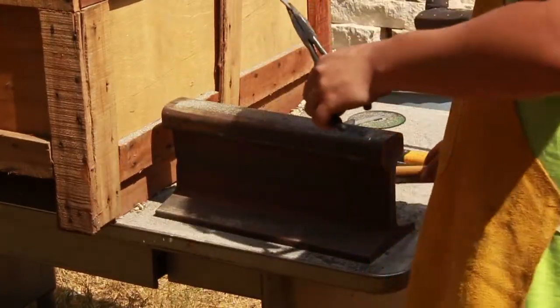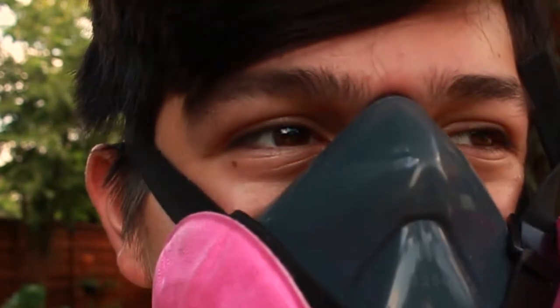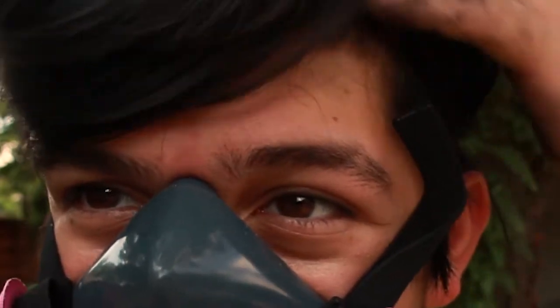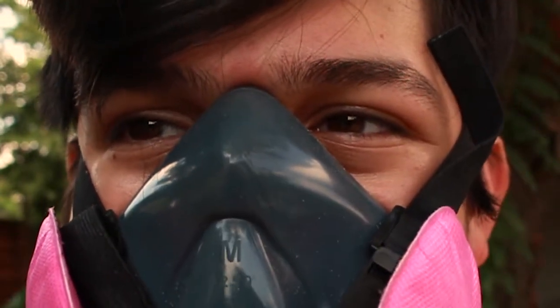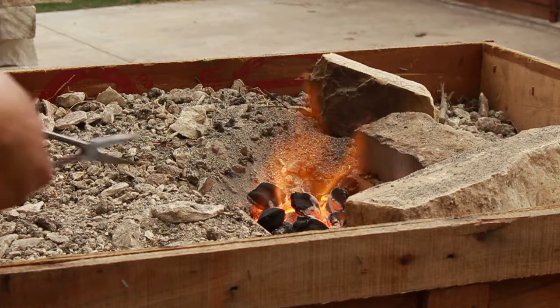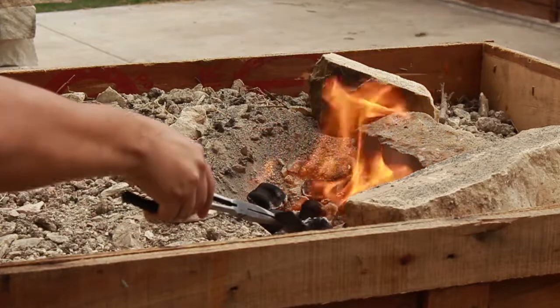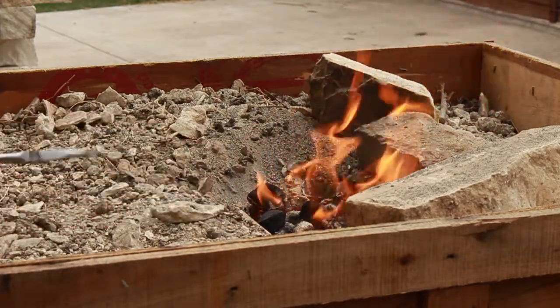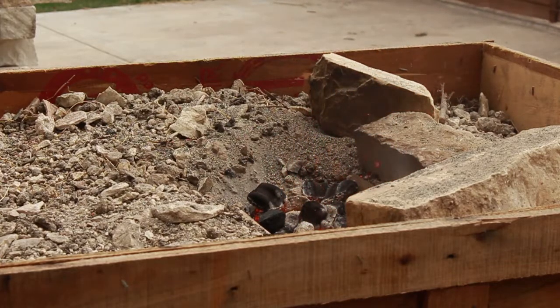Sharpening the blade is going to take another couple of weeks sadly. Lesson learned: if you want to make a curve in a blade, always do that before you begin to flatten the rebar — if not, it's going to be really hard. I'm learning that the tough way. So right now I'm just going to straighten out the blade and flatten it again because I lost some width trying to do what I was going to do. At the end of this clip, what I'm talking about happened — I left it in too long, compacted too much coal, and it didn't heat up evenly. I left it in for about 30 seconds and it melts off. Very big bummer, but we're learning.